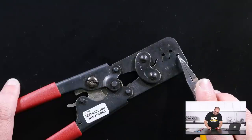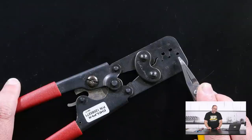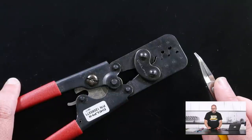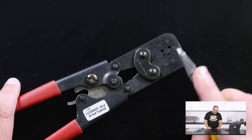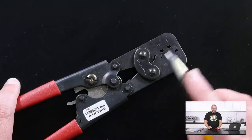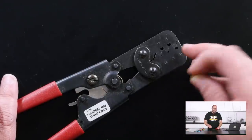When it comes to choosing the die size on this general purpose tool, it is sort of a trial and error process. You want to undertake a few test crimps and observe how they've gone, and you'll see pretty quickly whether you've got the right size die. If the die size is too large, the crimp will be loose and pull off the wires very easily. If too small, it'll be very difficult to actually crimp — you could possibly damage the tool and it's going to almost shear the open barrel crimp in half, leaving big ugly burrs. For my middle size splice I know the A size die on the end here is a perfect size for the application.